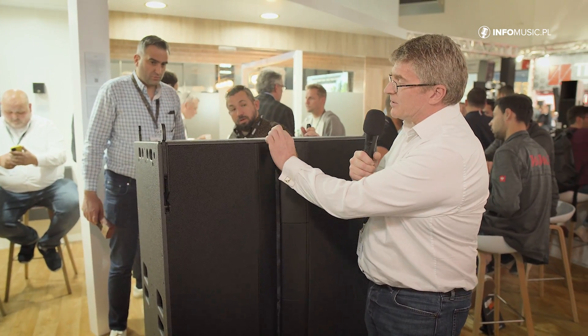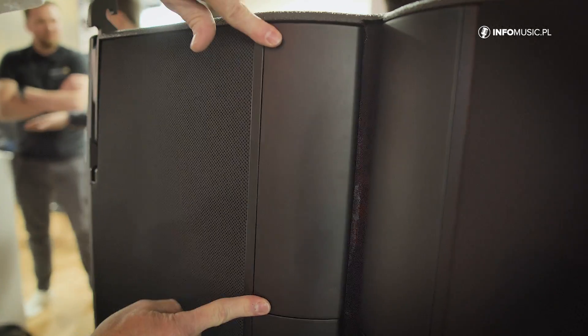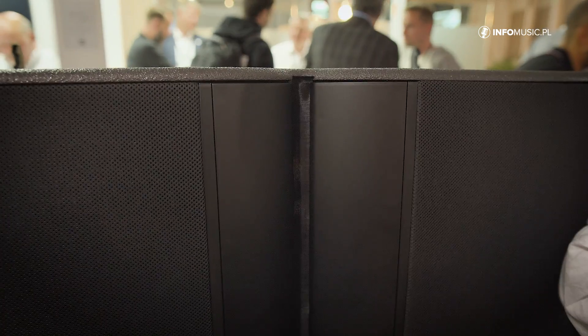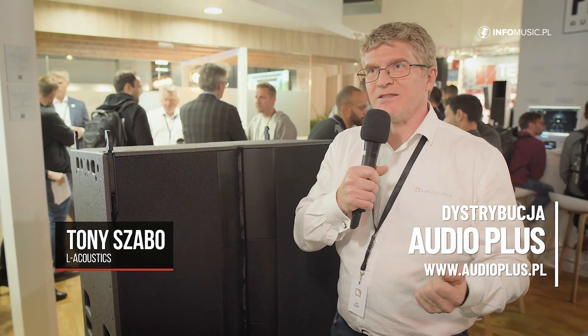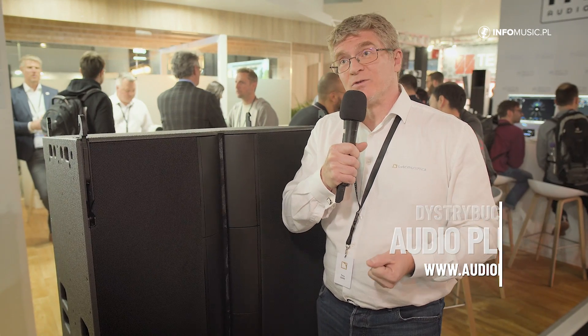You'll also notice at the top of the cabinet there's a very small gap to the next cabinet. When you have four cabinets joined together — and they touch each other when joined — we maintain a very small gap, keeping the ARF factor high. This means that when you walk from the back of the room to the front on axis, it will sound like one driver, because everything is combining near-perfectly with no interactions between them. That's what this increase in ARF is doing for us.